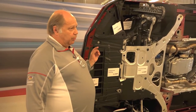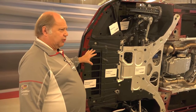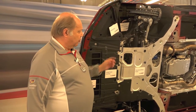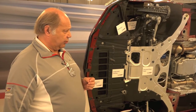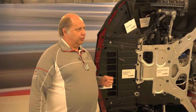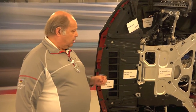The other element that made us increase this capacity is the fact that we chose to cool the differential by using transmission fluid. Since a transmission is essentially a very large pump, we now pump transmission fluid all the way to the back to the differential and all the way forward, using that same cooling system to cool both the differential and the transmission.